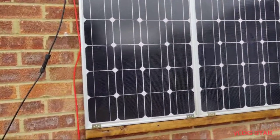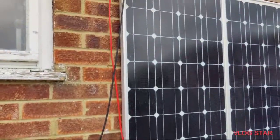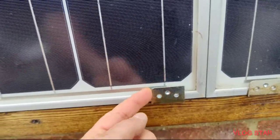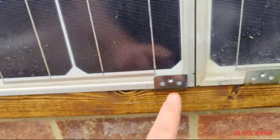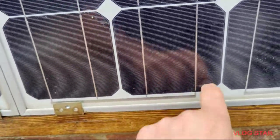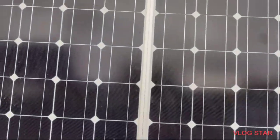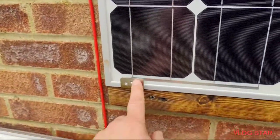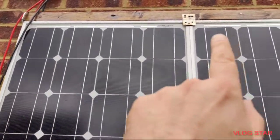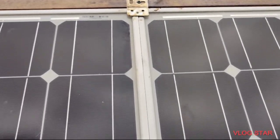What I've done here is I've taken some just short of 2x2 timber, top and bottom, screwed that to the wall and used these brackets here — just get them from any hardware store. Two on each panel on the outside as you can see there, it stops them falling off, and one on the inside which you can't see, facing the opposite way, so it kind of locks it into place. At the top I've literally just put two of those but reversed, so the panel sits against it, then I flattened one of those brackets out and just screwed it in and used it as a clip to hold the panels in.